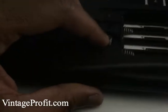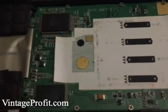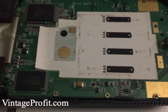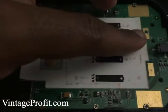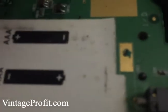I'm just gonna open it up and see what's going on with the board. This tape is really, really trash. As you can see, the board just needs to be cleaned up — it's very dirty. And the reason why this does not turn on: very simple fix. You see this copper plate right here? There's a spot where it wore down to the board — there's no copper right there.